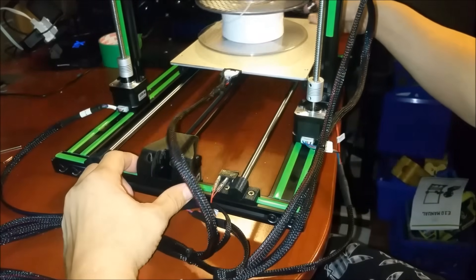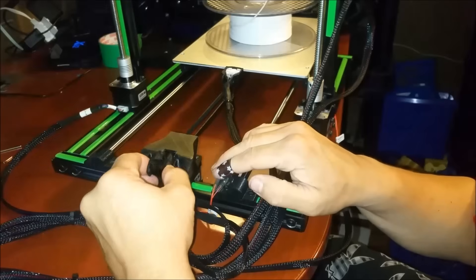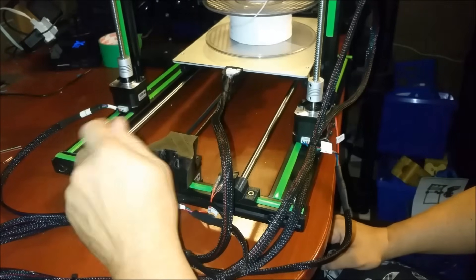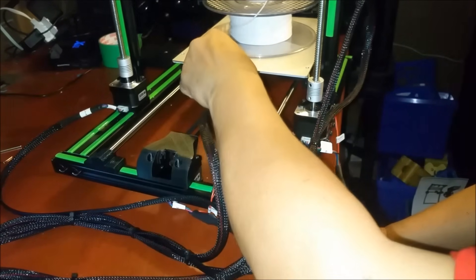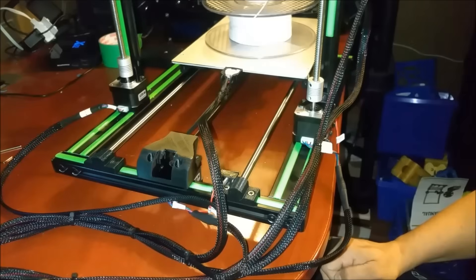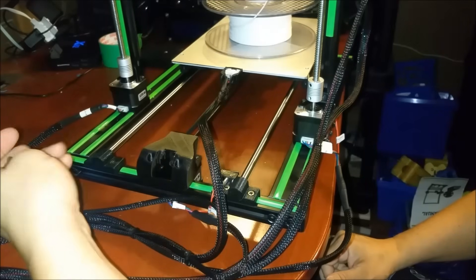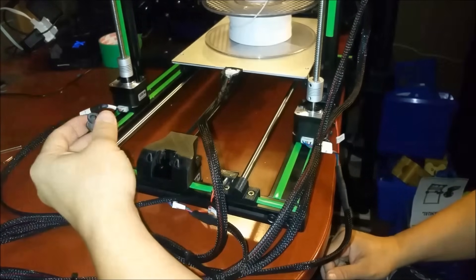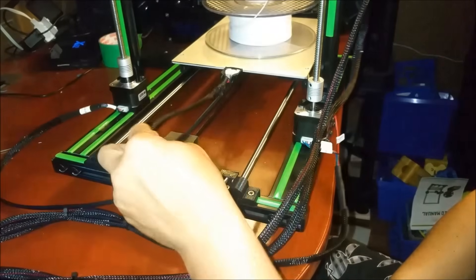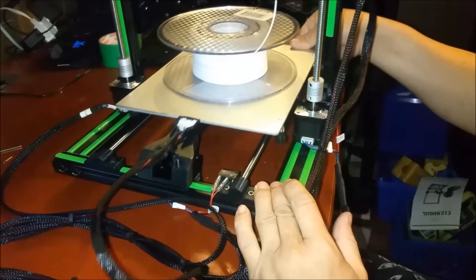This is the design I came up with so far. It's got the built-in connector for your cable chain links — they'll just snap right in there. This is my prototype; it's a little rough looking, but the finished one is a lot better. Same with this piece — also a prototype. I always print out my designs and try them out before I post them. When I do finish this, it will be up on Thingiverse for anybody to download. If you want to hook up a cable chain to this, you're going to need some distance behind the printer. It will protect the cable, but I think with the shroud, you might be a little better off than before.